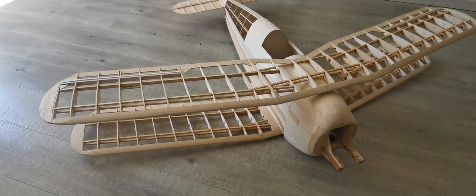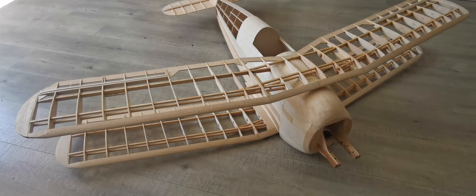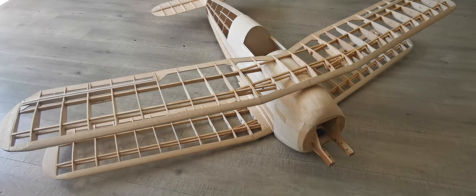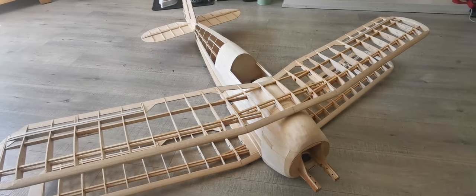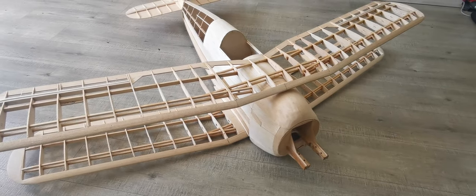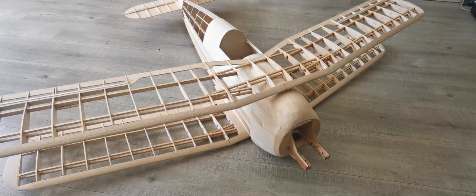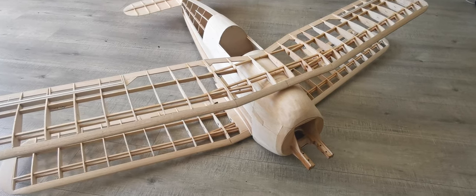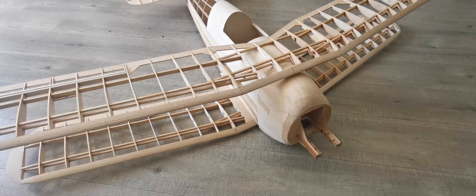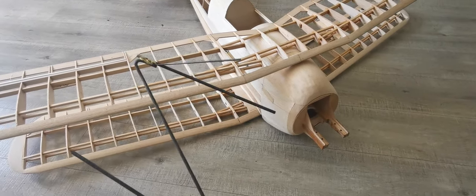Presumably that is to ensure that it's the lower wing that stalls first, which would make for a more stable aircraft no doubt. That's going to involve some careful morticing out on plywood to produce a jig that will allow me to set up the cabane struts, which have been partially formed.